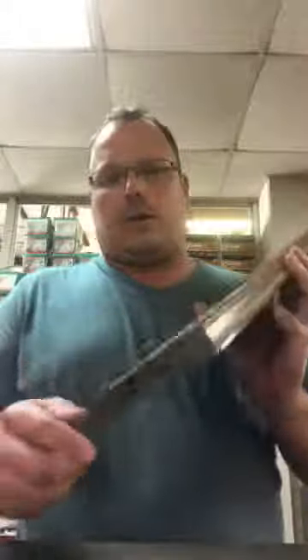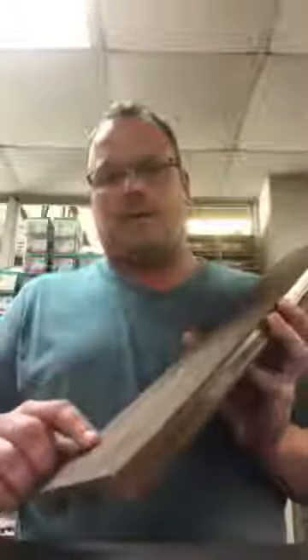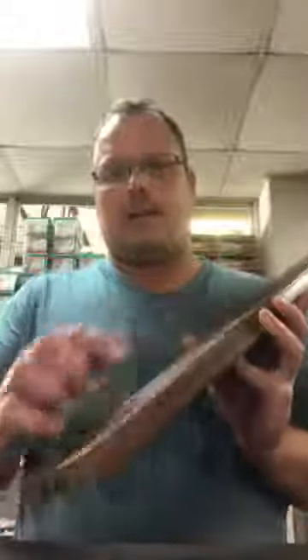And then there's this one here, which is river stone — so three colors available. I've got this dark brown one and the tan leather in stock here now. You'll notice these boards don't have the groove in the side. The 20-footers come solid edge, so you don't have to rip them down for stairs. In 12-foot, 16-foot, and 20-foot, they also come grooved for the hidden fastening clips.